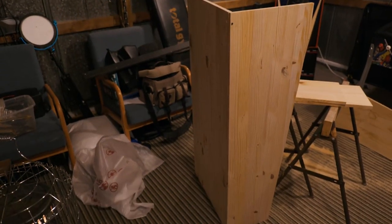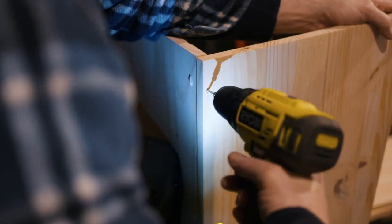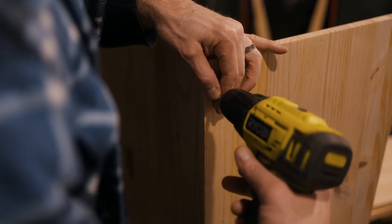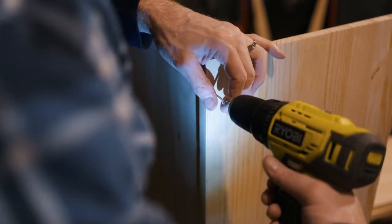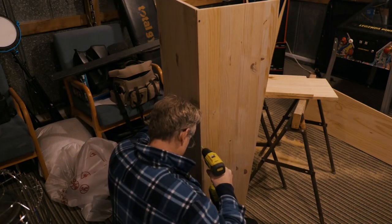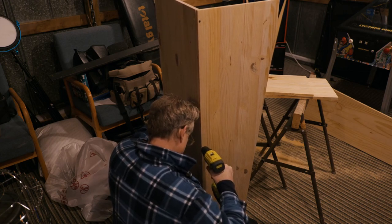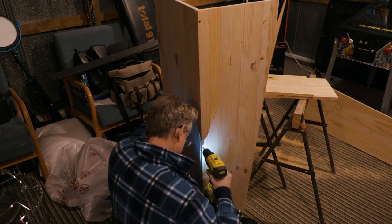You can make this to your own desires, but this is the design I thought could look good. Here I am just drilling in the pilot holes and seeing if the screws are going to work — I just had the screws laying around. Just take your time, no rush. Drill your pilot holes and make sure the screws aren't going to split the wood when you put them in.